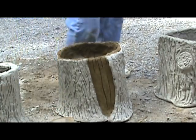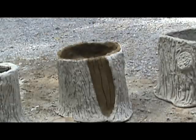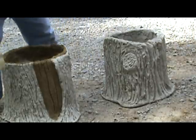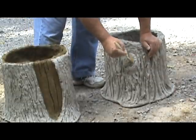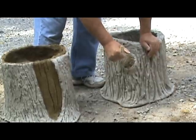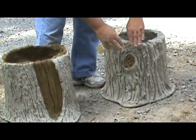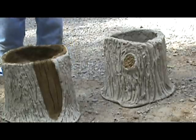And then over here, I'll move over here a little bit. Same thing here, I have two areas that I want to stain a slightly different color. One of these being the end grain of a simulated branch that has been cut off or knocked off and left a stump, a little stub of wood sticking here. And when trees try to heal, the cambium will grow and pull the bark in kind of a curved arc around the broken end. So that'll be a slightly different color.